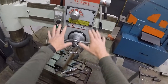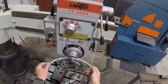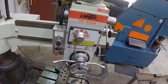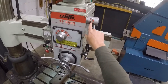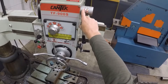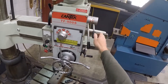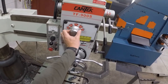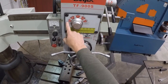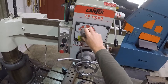We also have our feed — how fast it's going to feed. This here is our feed. We lock that in for our automatic feed; otherwise we can just lower by hand. You could hand feed this or have the machine feed it down for you. Feed rate one feeds slowest, two is a little quicker, then three — and this comes off the chart. This one has a feed rate of three if we're using L and two, so we would set this to three.